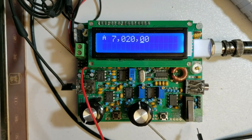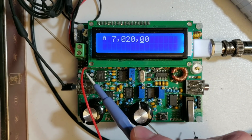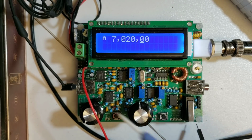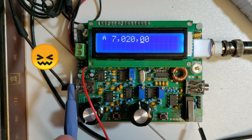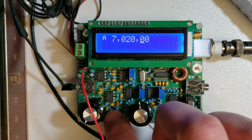Now, if you don't have a DVM or an oscilloscope, you can still do a fair amount of debugging by using the QCX's built-in DVM. To access this, you connect a wire to the bottom of the 1x3 pin header here on the left-hand side of the board. Again, make sure not to touch anything against the 2x3 program header. That's the cause of quite a few problems.